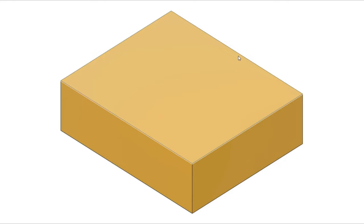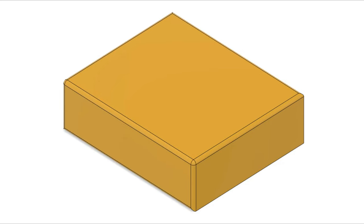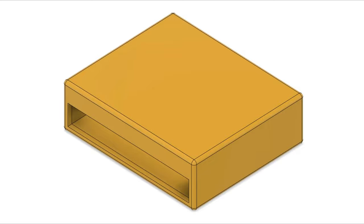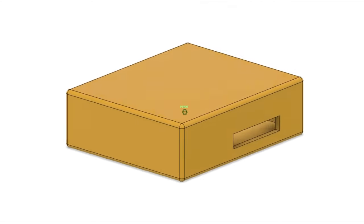So we'll start with a basic box primitive, which I've dimensioned using measurements taken directly from the TapeCart. I've added a couple of millimetres all round, as the measurements of the TapeCart are the internal dimensions. We'll chamfer the outer edges for a cleaner look, and so there's no nasty sharp bits of plastic. Next we add in the slot for the edge connector and the SD card.